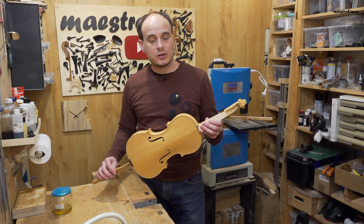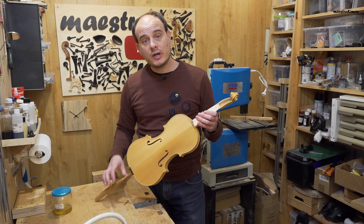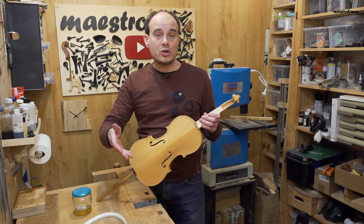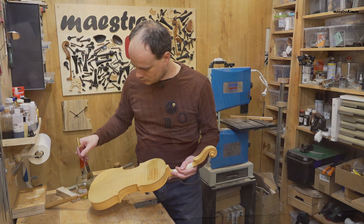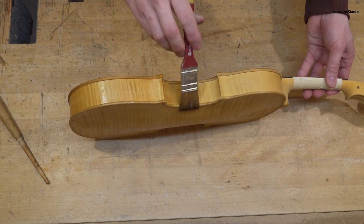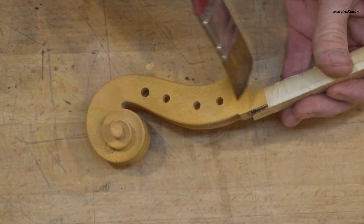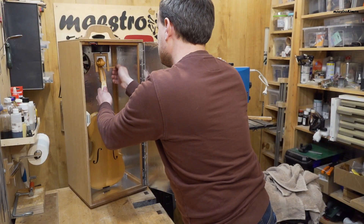A and B of the Italian ground are dry. The instrument has this beautiful golden brown color. Now I will go ahead and apply the sealant that I like the most, which is Mastic dissolved in alcohol until it is saturated, and I will use a brush to do that. I will then put the instrument again in the drying chamber.